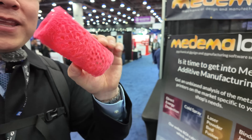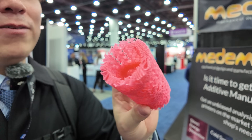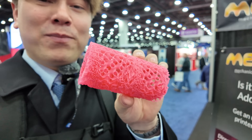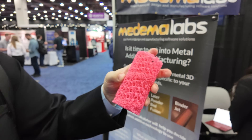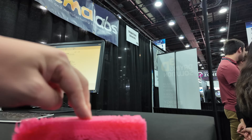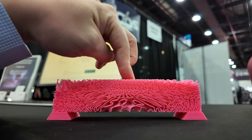There are some interesting algorithms going on. And then next up we have a variable density infill — this looks like gyroid infill. I guess they can assign material properties in different directions, change the density to make it stronger, heavier, or lighter. And it looks like they can get some directional material properties here. This is a little beam bending problem — they've strengthened it in certain ways. This is a pretty classic design problem in structural engineering: you're trying to make a bridge, you've got two supports, then you're pushing down on the top. This is supposed to support those loads and be strong in certain directions.